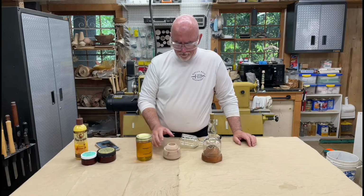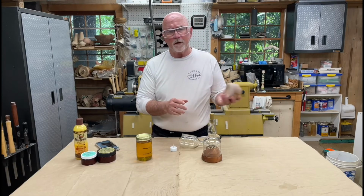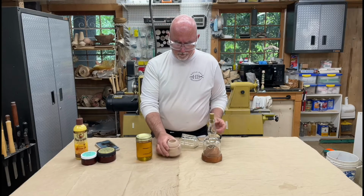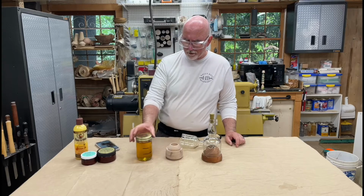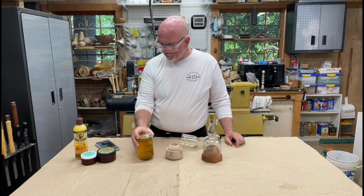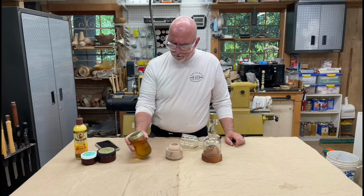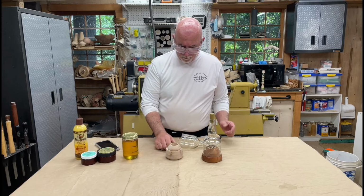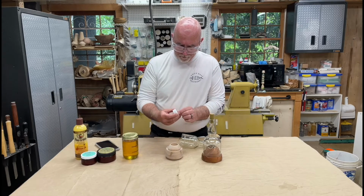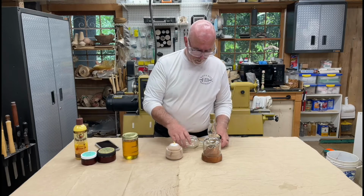So here we are wrapping up. We've sanded the piece, probably on the lathe, and what I usually use for a finish to really pop the grain is a third each of tung oil, poly, and mineral spirits, and you can mix it up yourself. You can see the lines here, and let's just put it together. I'll get the light on if you want that.